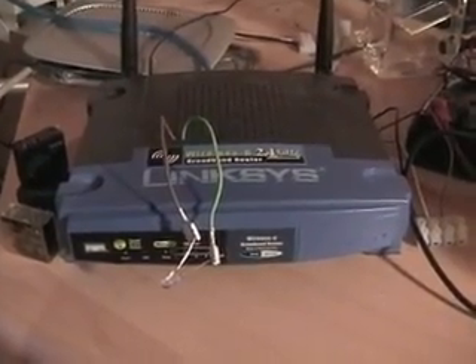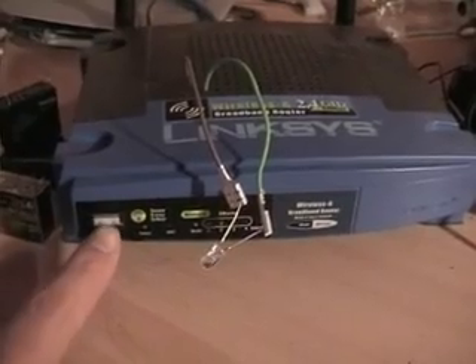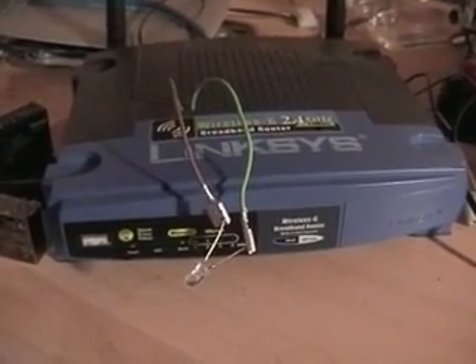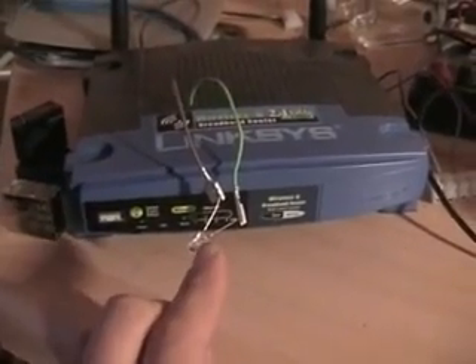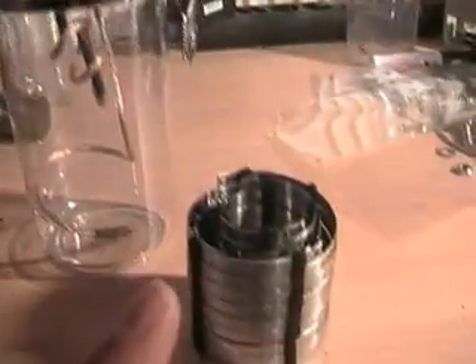The next thing I'm working on since yesterday — I had a quick idea. It's the WRT54G model by Linksys, and the LED you can see here is a replacement for an SMD LED that was in there before. This LED is connected to a GPIO general purpose input/output pin on the board of this wireless router, and I can switch this LED on and off by software. I've heard those pins are good for switching rates of up to megahertz, so I'm thinking about putting an optocoupler here, a MOSFET to this optocoupler, and maybe I'll have a pulsing system ready for this cell.